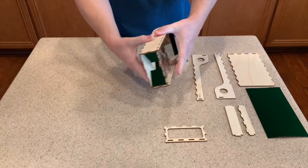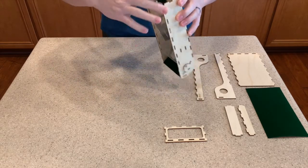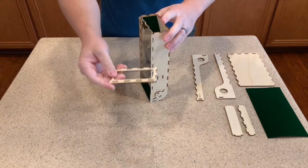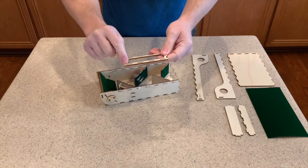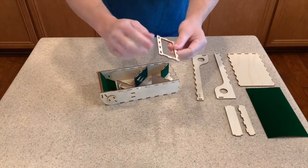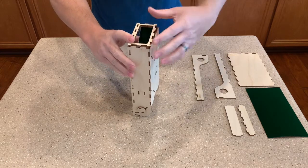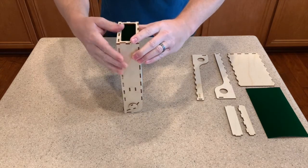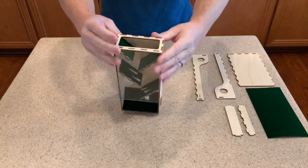The last step for the actual tower portion is the top. Put a little glue in these valleys around the top here — don't do it on the front because you don't want it squishing out into the acrylic. It helps to orient the piece so the burn marks from the laser cut go into the assembly — it's very faint but you can tell which side was being cut through. It's a little bit tighter on the bottom side, so when you flip it up and put that inboard it'll go together a little bit easier. Work your way around slowly — it's a somewhat thin wall, strong, but you could crack it if you really bear on it.